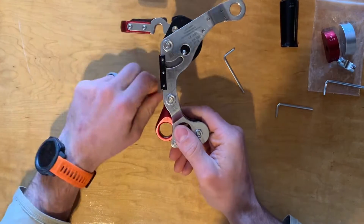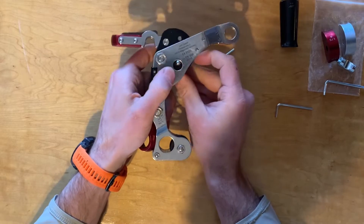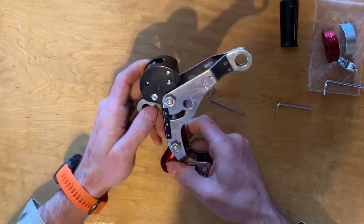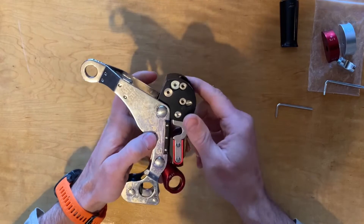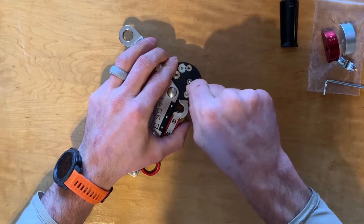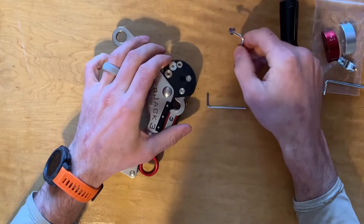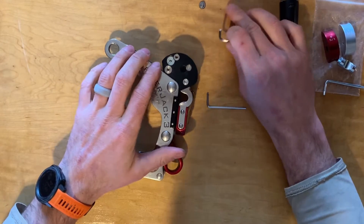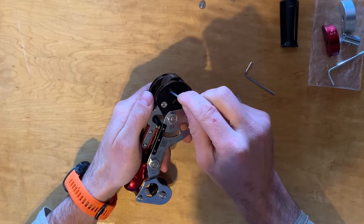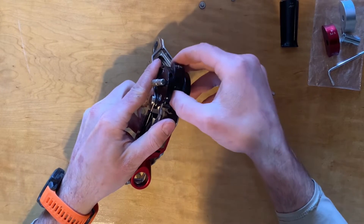What we want to do is push this forward, push it down to the normal lock position, then push it even further and pull it completely out. That will expose these screws that we can now get to. We want to take out this screw right here, break that loose and back it out. Now that we have that screw out, we can turn it over and use an allen wrench to push this pin out from this side, and you'll see that the friction clutch just comes right on out.